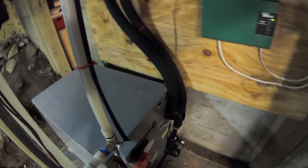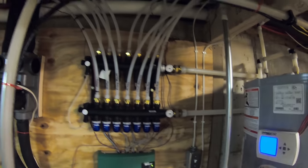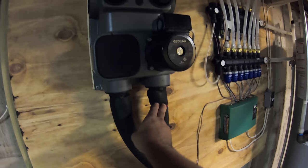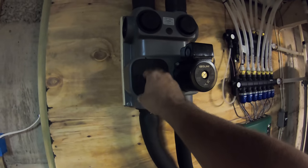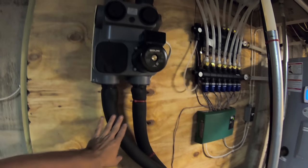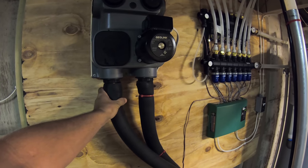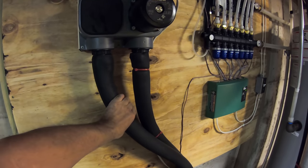So when this is heating, the return coming back into the ground is usually almost frozen water. When you're using this system to heat from the ground, it's coming in with 50 degree water, and then out is coming a lot colder water, even almost to the point where it's freezing. And you can actually freeze up the ground if you size the loop wrong. So I believe there is glycol in the ground loop for that reason, because a lot of times your return is going to have freezing temperatures going into the ground. That's why you need to have the antifreeze or glycol.